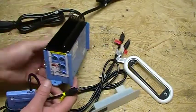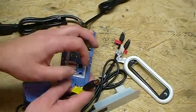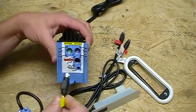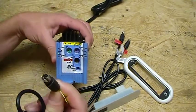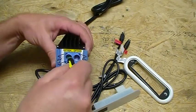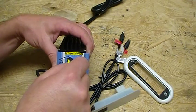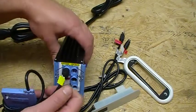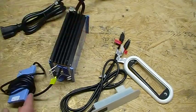The control box looks just like this. We have our option plugs and our display plugs. Everything is very simple folks. Now, what's not simple is this pin pattern — you very, very need to make sure that these pins line up. If you bend any of these pins when you're putting this together, you're going to have a problem. So make sure you line those pins up perfectly before you put that together.